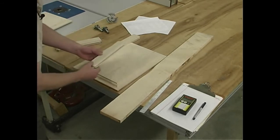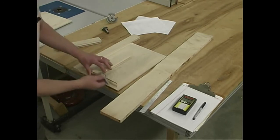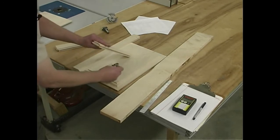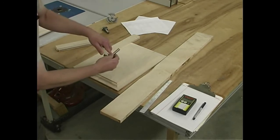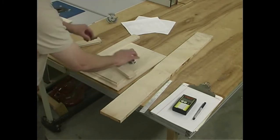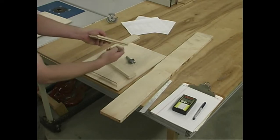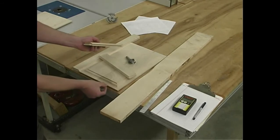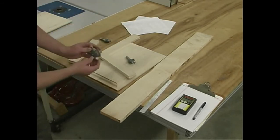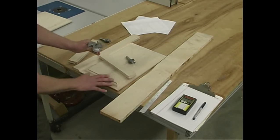Now, as I mentioned, it pays to take your cutters and make up the components. It'll get you familiar with your cutters before you actually have to make a functioning project. But this particular set, there's the cutter set up for coping the ends of your rails, the cutter that does the cuts along the inside edge to create the profile. It also creates the groove to accept the edge of the panel. Then there's the panel raising bit itself that puts the face profile, so to speak, on the field panel.